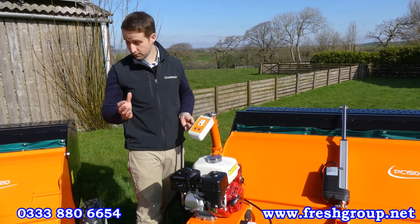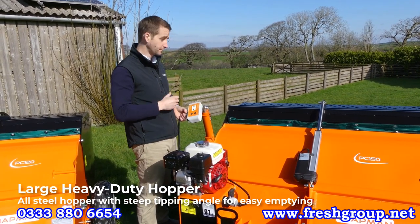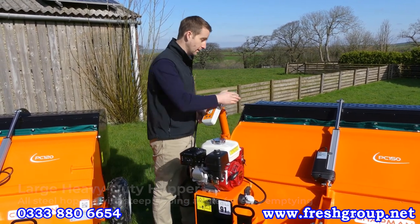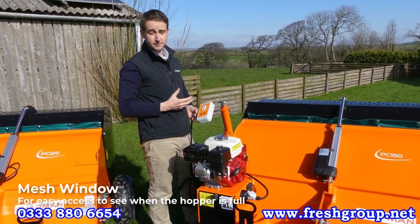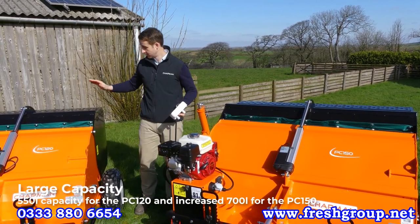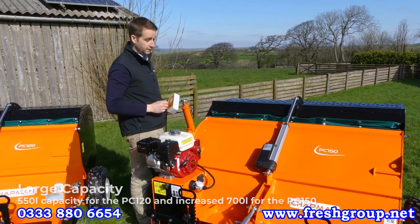With the PC120 and the 150, you've got a fully steel hopper, tips to a really nice steep angle, so you can just reverse up to your muck heap or wherever and unload easily. You'll notice as well on the front of these, they've got a mesh grille here. So this allows you to see when the hopper is getting full, so you know when you need to tip. Hopper capacity, approximately 550 litres on the PC120. And 700 litres on the PC150.